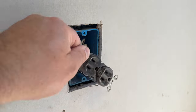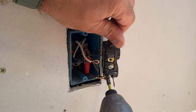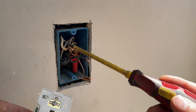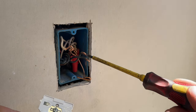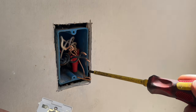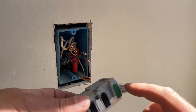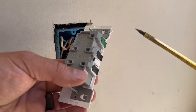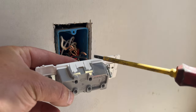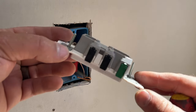Let's go ahead and start by removing all of our wiring. Now that we have our outlet off, our white is always going to be the neutral wire and black is always going to be your hot leg. Power comes in through the black wire and returns through the neutral path, with your ground as a fail safe on the green terminal. Some older outlets were confusing — the hot side was bronze and neutral was silver — but with these new outlets they are black and white, so they're very easy to install, really hard to mess up.